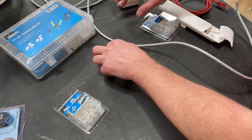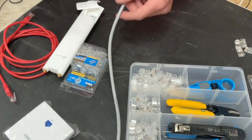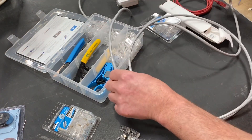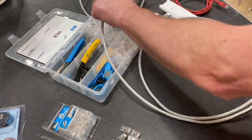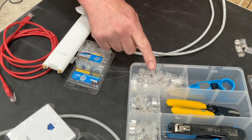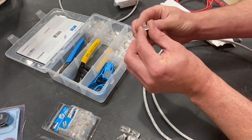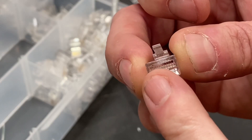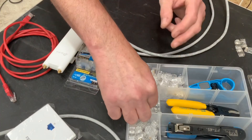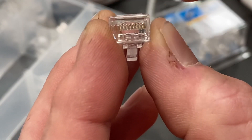Let's rearrange the table and bring in the kit. We'll look at making off a piece of Cat6 cable using the appropriate tools from Ideal Industries. We've got a set of both Cat5 and Cat6 ends here. Just one little thing: the Cat5 ones have a little curve at the top section, whereas the Cat6 ones are just straight across that part — they're straight.